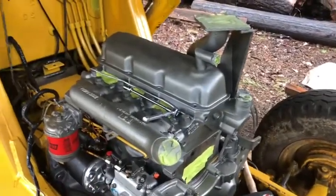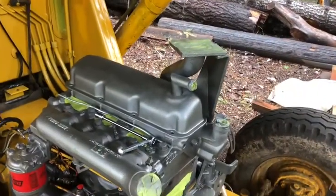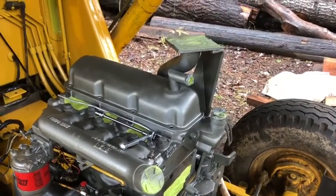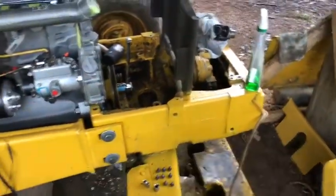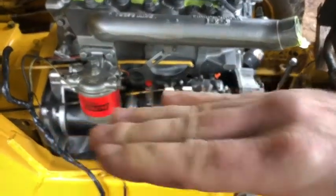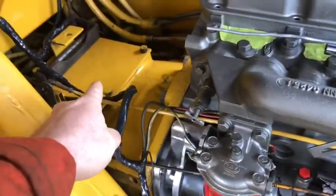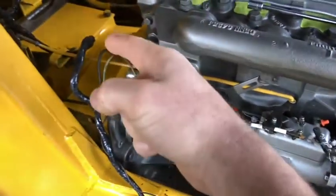I was able to sling it from up high with the tarp off, and had an excavator lower it in. Then I could make all my adjustments with the Keto jacks - you can just very gently pull the handles and adjust like a 16th of an inch at a time. The front was a little bit further forward; I was able to drop it right down in there, adjust the Keto jacks to get the proper angle, and slide it over my four dowels.